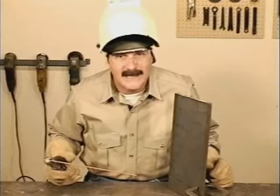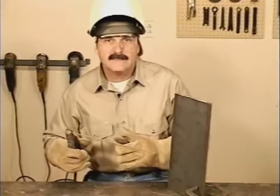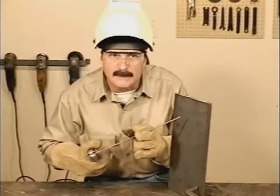Watch the outside edges to keep the weld bead straight and travel fast enough to stay ahead of the molten puddle. If you can't stay ahead of the molten puddle coming down, try moving a little faster or raising the amperage setting. For more weld buildup on heavier metal, 6013 can be run uphill.